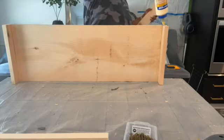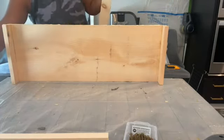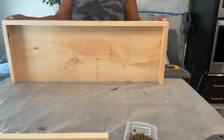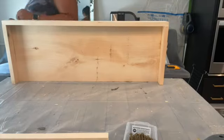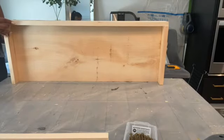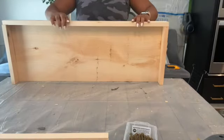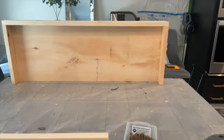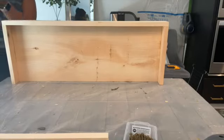To walk you through this shelf build one more time, I'm going to start from the tray position again. Then I'm going to add my backboard, because remember the very next step is going to be attaching those support boards through the middle. The tools haven't changed — I'm repeating the same steps by applying wood glue, then using my brad nailer, and then of course using those multi-purpose screws to attach the support boards and mount to the wall.